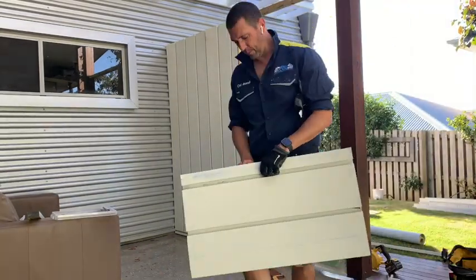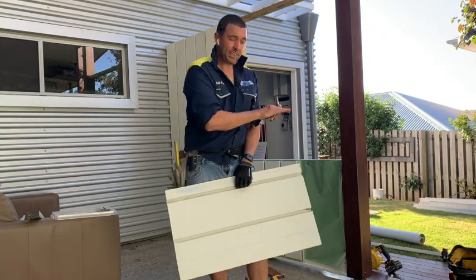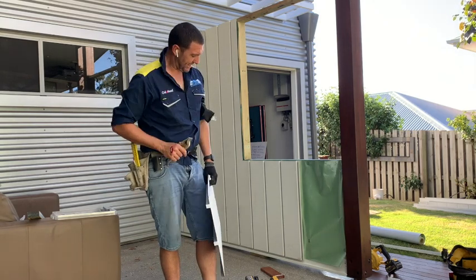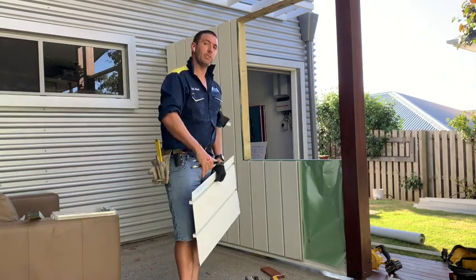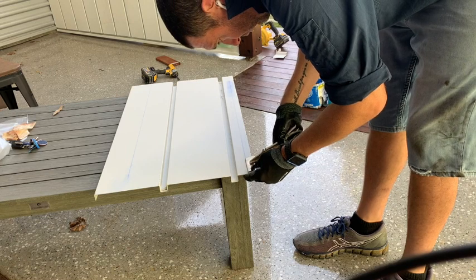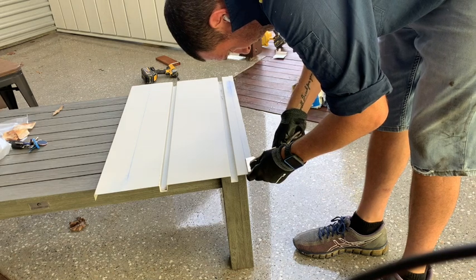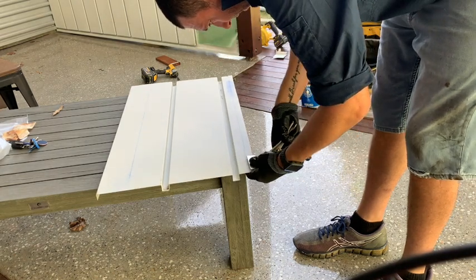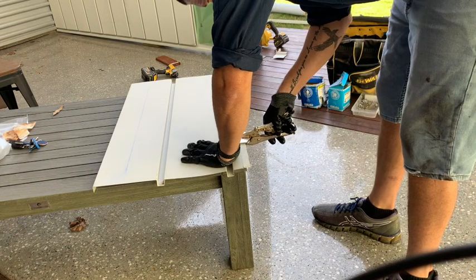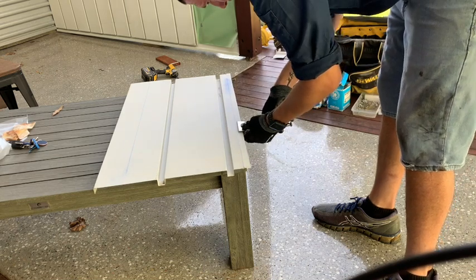This last sheet that I've had to put in — I'm trimming it down. I'm going to attempt to fold a nice clean fold in there so it tucks up and butts in really nicely to the post. If it doesn't work, I can always just order a little cover flashing that sits in there. But I want to save some money, so I'm going to see if I can get a really good result. I'm going to put this right on the blue chalk line — tighten that up, then put only a very slight, tiny little bend in it and work my way down.